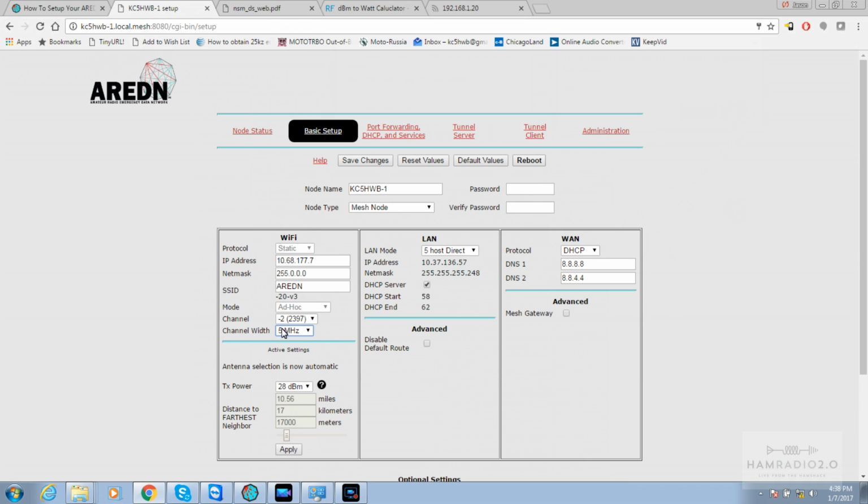And I changed my channel width because I was talking with some of the local guys here the other day, and they said that their nodes are set to 5 megahertz bandwidth. I am told, I don't know if this is true or not, but I believe it is, if you have two nodes running on the same channel but the bandwidth is different, they won't see each other. So if you're building a network with a bunch of your ham buddies out in your area, make sure you're all using the same channel right here and the same bandwidth.